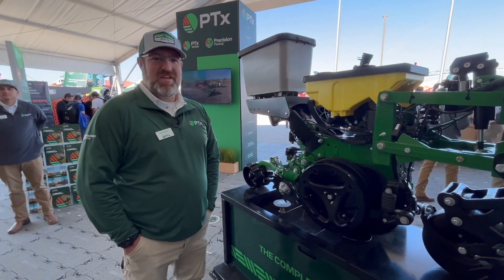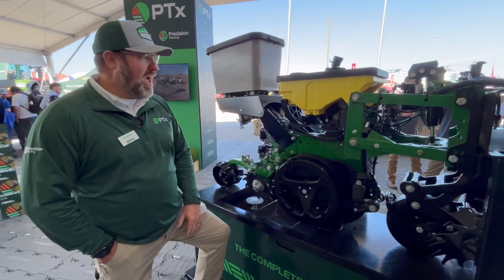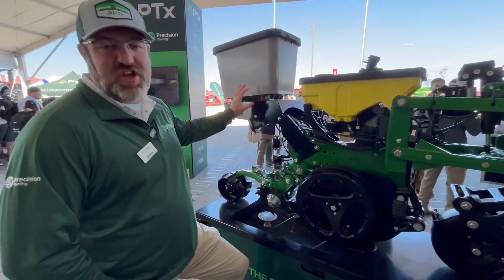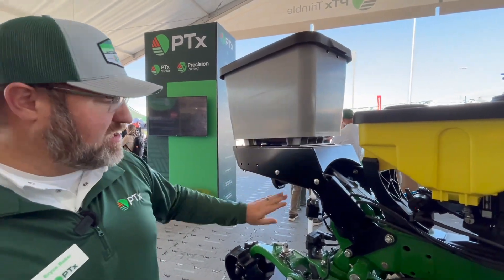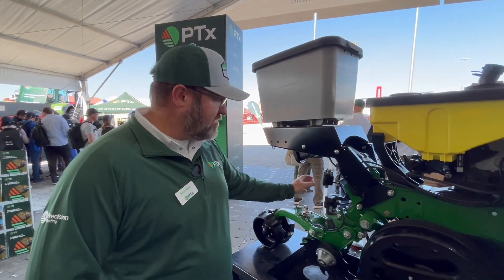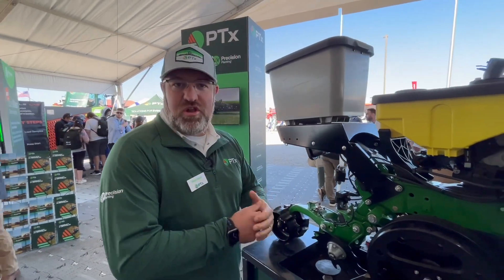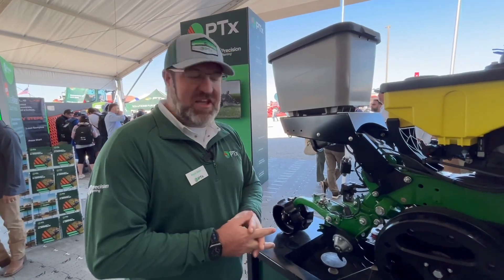You've done a retrofit. Yep. So this row unit, originally a John Deere shank, is a retrofit with a number of products: electric drive, automatic downforce, fertilizer delivery. But a new thing we're showing here at the show is this apparatus — Dry Set Micro. It's a regular insecticide box that can distribute either insecticide or granular micronutrients down in furrow. There's a blockage sensor that goes along with that so you know product is flowing, and it allows a farmer to have row-by-row control of rates, swath, and their micronutrients or insecticide as it's being applied down in the furrow.